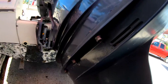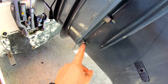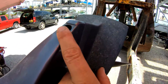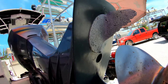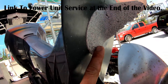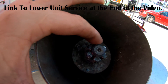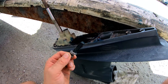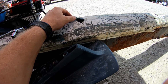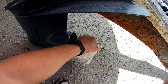Now it's time to take the lower unit off. You've got six 14-millimeter bolts, three on each side. The anode you access from here — it's a 12-millimeter bolt, and then there's a 14-millimeter in there, and underneath this anode is another 14-millimeter. Take your cotter pin out here with a 1-1/16 inch. When you go to put this back together, you want to make sure you have one bolt ready and greased up, have a 14-mil ready, and make sure this is in neutral.